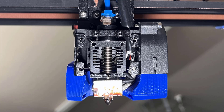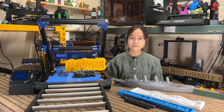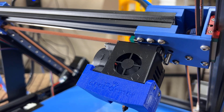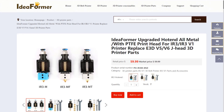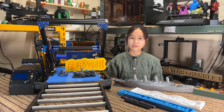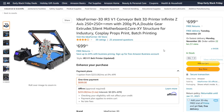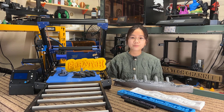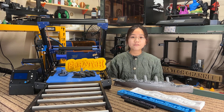The major upgrade is the hotend. This printer comes with an all-metal hotend that can print at up to 290 degrees Celsius. Another improvement is the location of the X-limit switch, so you no longer have to mirror the model in the slicer. Ideaformer also has a hotend upgrade kit for the original IR3, so if you have the old one, you can get the kit for around $60. The retail price of this printer is around $700, and in this price range, this is probably the conveyor belt printer with the best hardware and largest print volume. Let's get started.